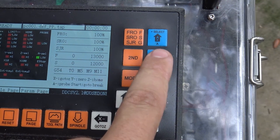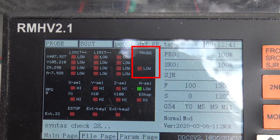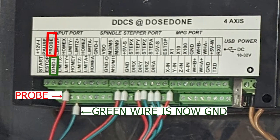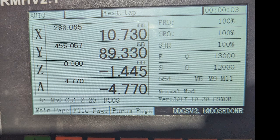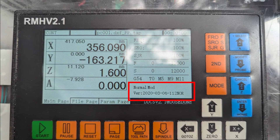The final part of wiring this controller was enabling the material detection. The DDCS has a built-in probe function, which will work perfectly for this application. The two wires coming out of the microswitch on the floating head come into the machine and terminate at the probe and ground pins on the DDCS. I had to make a few adjustments in the firmware to get it working, but that's really all there is. On a side note, the firmware on this DDCS controller was the original older firmware and it didn't support the probe function very well — it didn't really work at all in my testing. Updating the firmware to the newest version, which I'll link below, solved this problem.